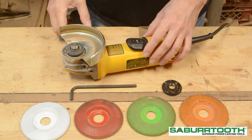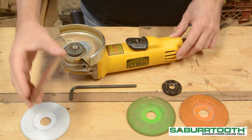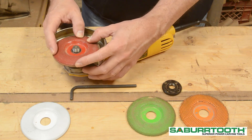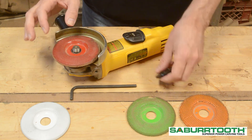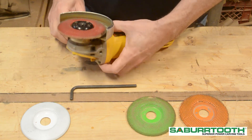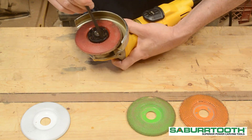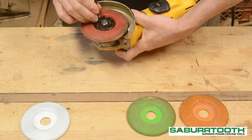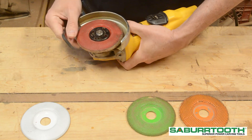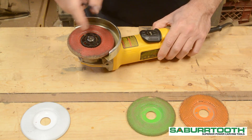The third tool I use in the garage for carving is this angle grinder. This grinder is designed to take a 7/8 inch bore. Installing the carving wheels is real easy — just put it on there, make sure it is seated properly, and put the nut on. This grinder has a button on the back to keep the arbor from spinning as you snug it up. It does not have to be super tight because it will automatically tighten due to the direction it spins.